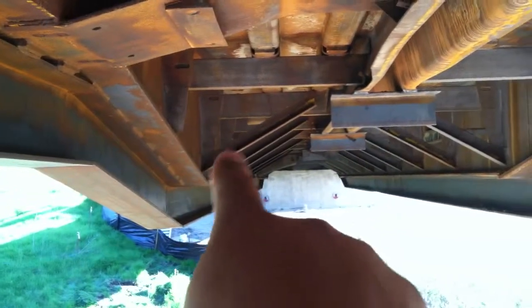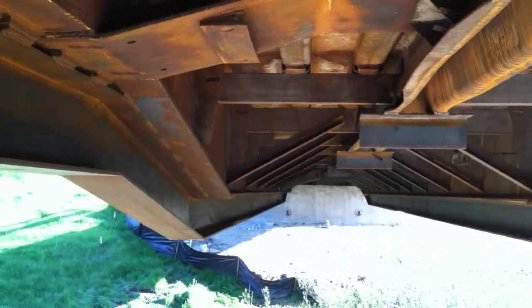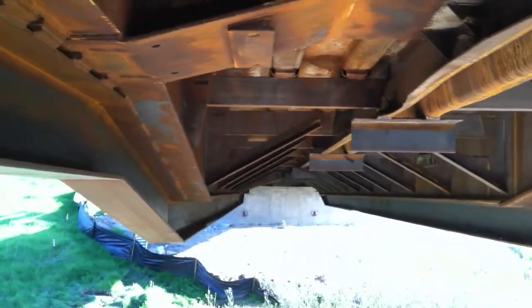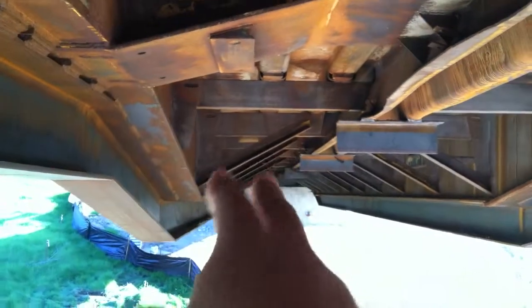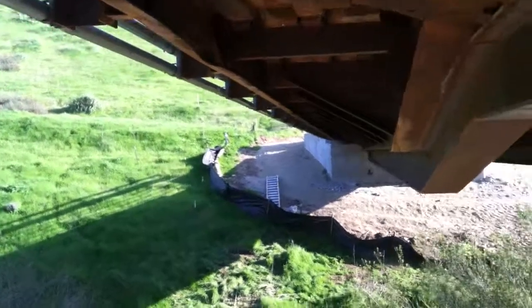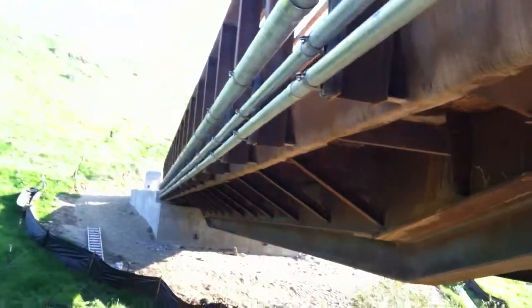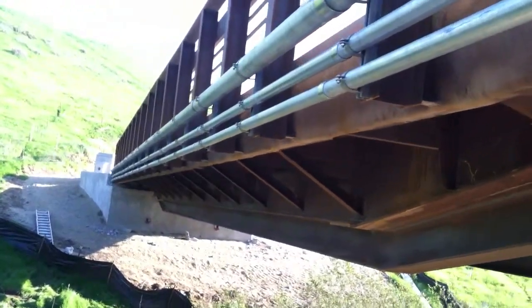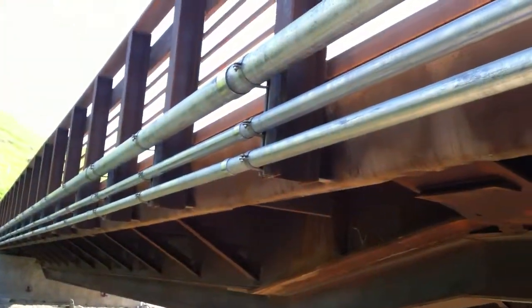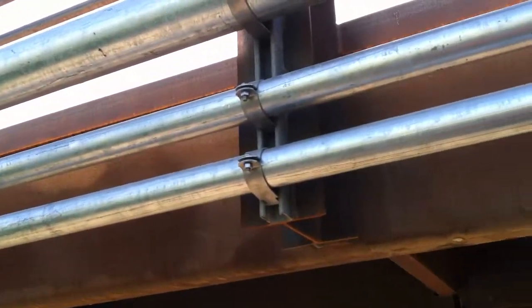So that's a possibility — we can put them on the inside. This happens to be two rail cars side by side, but it's the same principle no matter what kind of rail car you have, whether it's one or two. Putting unistruts underneath keeps all your pipes nice and hidden and nobody ever sees them. What's always easiest is hanging them off the side, and it's also easier to maintain or inspect them there, but they just don't look as pretty. Maybe if you painted them, that'd be a little nicer looking.